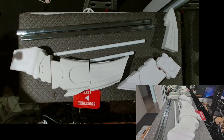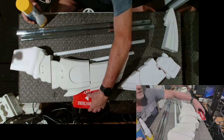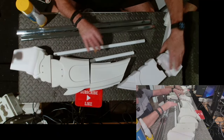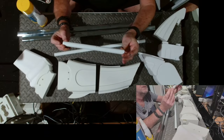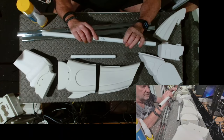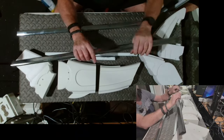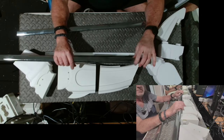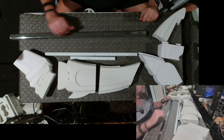These are all the parts for one leg — there are three identical sets. For one leg you'll need a 270mm length of 19mm tube, a 550mm length of the same tube, and two 800mm lengths of an oval-shaped shower rail — 30mm by 15mm. There are six printed parts per leg as well.